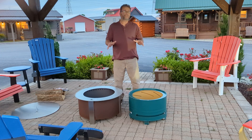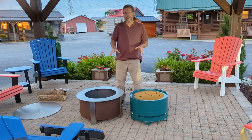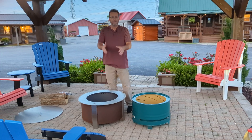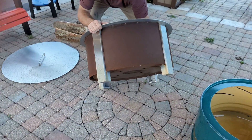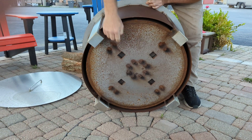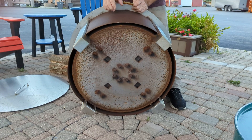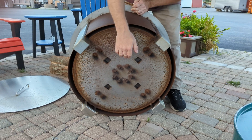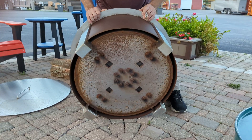The reason I'm doing this comparison today is I want to talk about air flow — primary air and secondary air. So the primary air on the Amicus versus the competitor's 24-inch model. Right here you've got four air inlets for the primary air that feed the fire from the bottom. You can check the description for the math, but these four holes together total 7½ square inches for primary air.